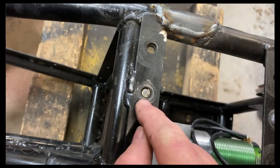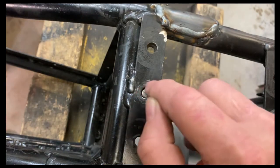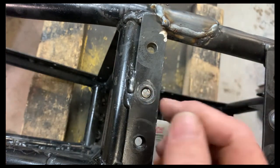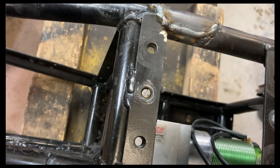There are a couple of techniques you can use to do this. What I'm going to do is get a Dremel tool with a little cutoff saw and just slice a slot right in the middle of it. If you make a little slice right through the middle of it, you can actually screw it out with a screwdriver, because it's just like a normal flathead screw. So let's get the tool and make this happen.